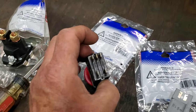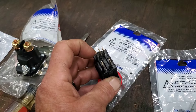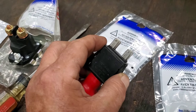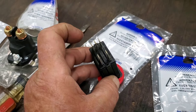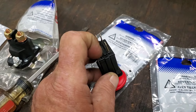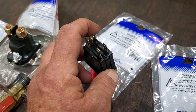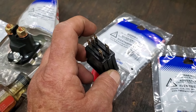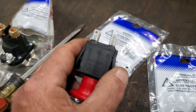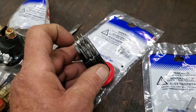With the PTO switch in, you connect the outer terminal to the outer terminal. When you pop that button out — like you engage your blade — you connect the outer terminal to the middle. I'll also put a link about the PTO switch in the description. To test the safety switch: clip a terminal and clip a terminal. You see OL — no connection. Mash the button in and you've got continuity. Button out, OL again — that switch is good.